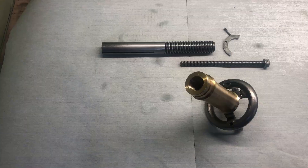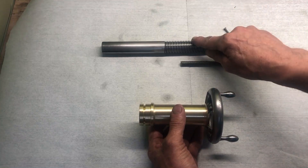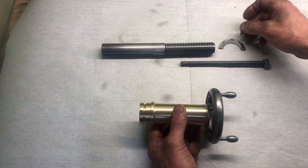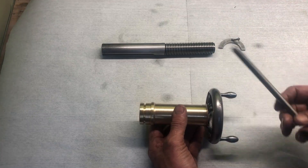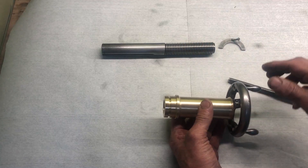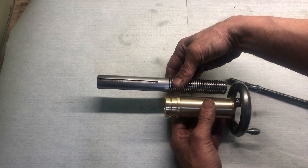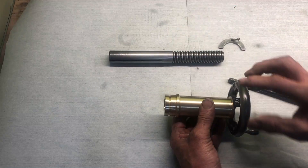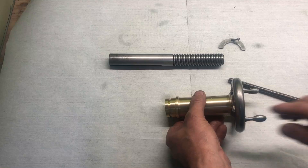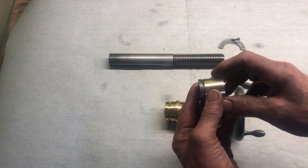For those interested in doing the same, this is really a very simple modification to the Myford ML7 tailstock. No changes to the barrel with the thread, or this washer or stop. Just added this as an extractor tool and this extension sleeve, to be able to go all the way without exposing the threaded portion here, so that it doesn't interfere with the action. This portion is just the same as the original, which I in this case also glued to a piece of bearing bronze.